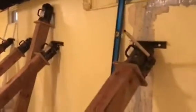What we're doing right now, we are just very, very slightly going to raise the floor joists off the top of that foundation wall, just so when we are pushing the actual wall back to vertical, we're not scraping against any of the wood right there. So we want to make this as clean of a transition as possible. So we're going to have a couple 6x6s vertically just to keep everything supported while we straighten the wall.